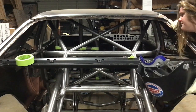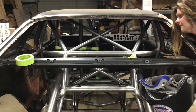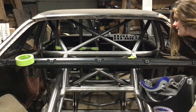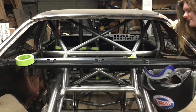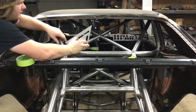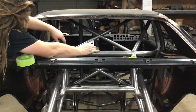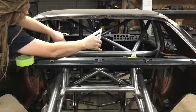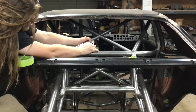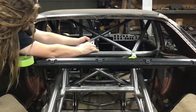Now the trick is going to be setting up the other two pieces so that they line up perfectly, both for visual and strength reasons. I've got them really close, but I just want to look down them and make sure everything's good to go. One thing that's really convenient about this 45 degree setup, or 90 degree, however you want to put it, is I can use this carpenter square to verify all the angles. And you can tell if it's slightly acute or obtuse just based on how this moves.